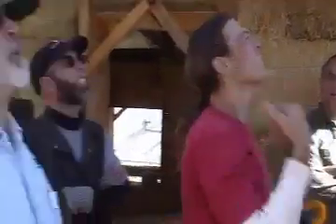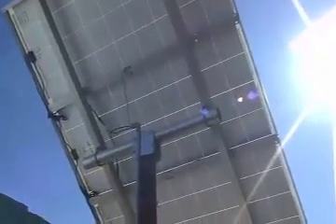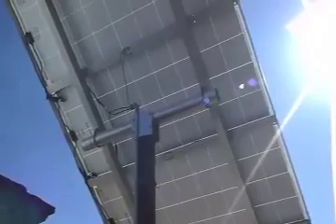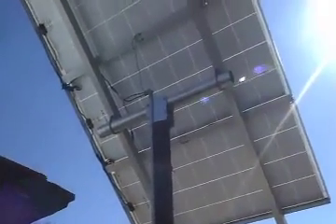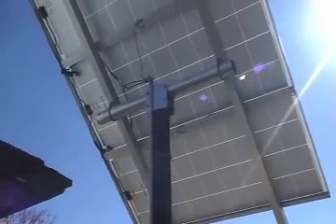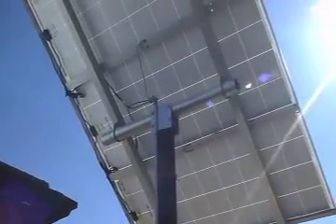You could expose the green wire and put a clamp on it, but typically you'll use bare wire because over time this is going to become very ugly — it's going to start shedding its insulation because it's not meant to be outdoors. That quick-connect black wire you see there is USE-2 wire. That's an insulation rating, and it's rated to be outdoors and exposed to the elements. We don't want to put it in direct sunlight, but it is rated for outdoor exposure.